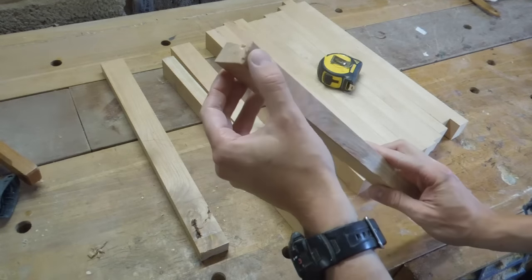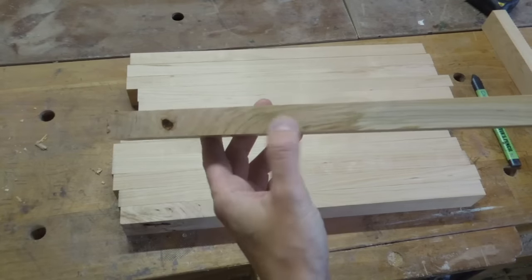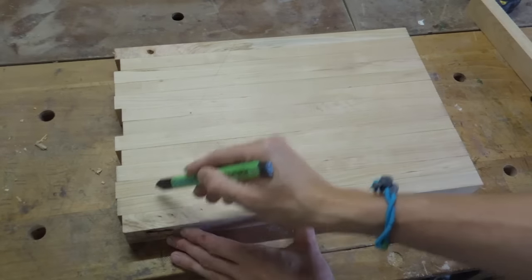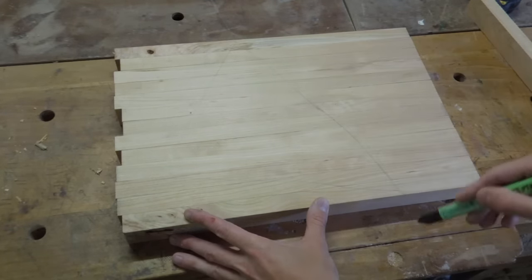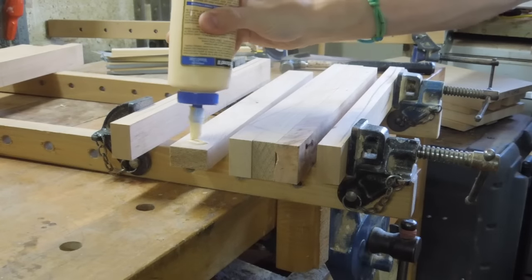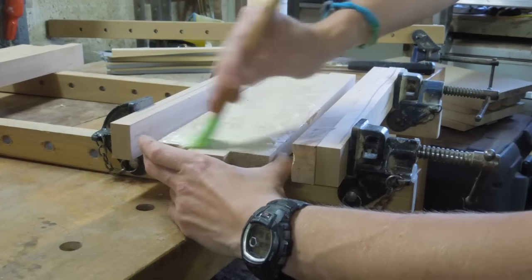Here I'm looking at the grain, looking out for any knots and defects I want to try and avoid. I'm also looking closely at the grain on the edges of these boards, because with curves like this I can use these to match the radius on the corners of my plate. I also decided it would be best to make this glue-up in three different sections, so I had less to worry about.